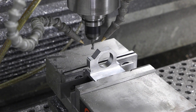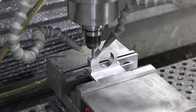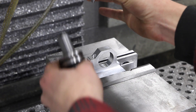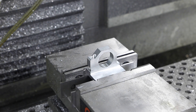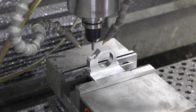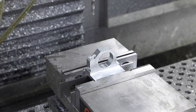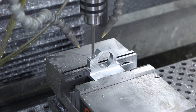Let's finish up here — using that quarter-inch end mill to make the little pocket for the recess for the socket cap screw. We're actually going to tap it in the machine, just not the way you might think. That was nice and quick. Switching to tool 25 to spot the hole — you can get by without spotting sometimes, but I'd rather do one extra tool change and know I have a good spot than risk a drill walking on a part I already have time into.